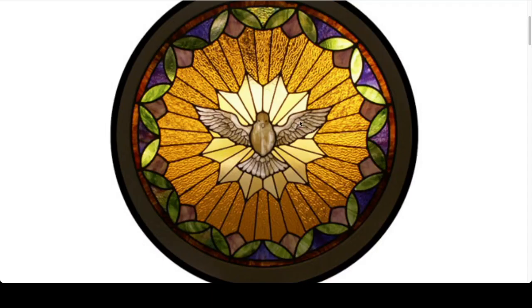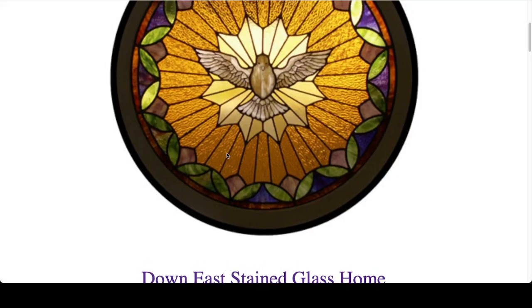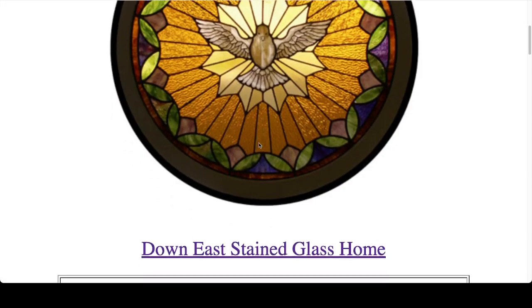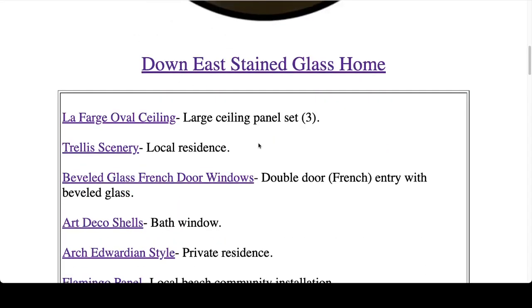But nowadays, most stained glass, when made, has an exterior glazing of clear glass. So you're not going to have hurricane force winds blowing against it, and it'll never be an issue where you need to reinforce this window if you use the high tensile leads. A lot of people don't talk about that, but you're hearing it from me. That's what I do. Lead is not lead. You have different types of lead, and different uses of lead.